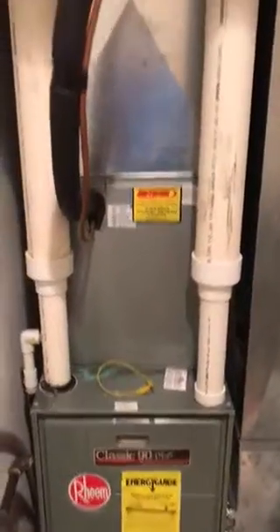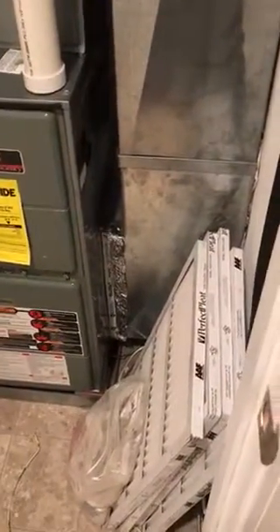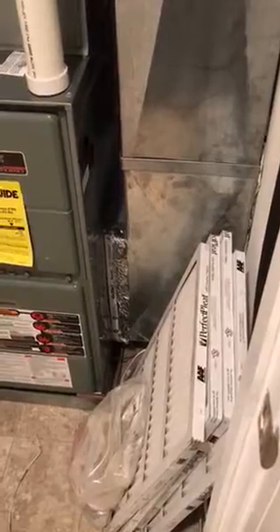Nick Santos left his jumpers here — I'll bring those back to him. We're going to flush the existing freon line because we're on the second floor and won't be able to replace these lines, so we just need to bring a flush kit for that.